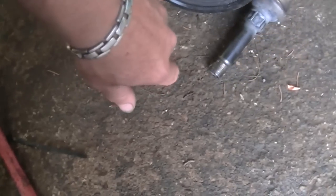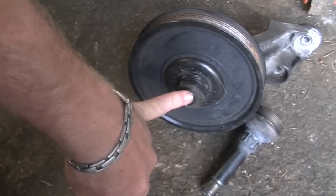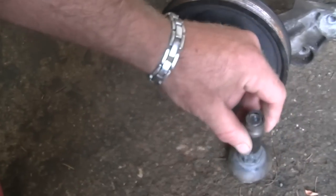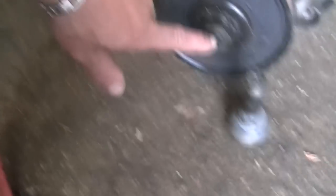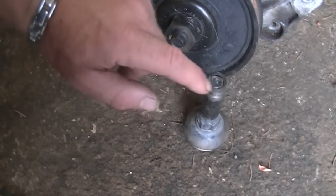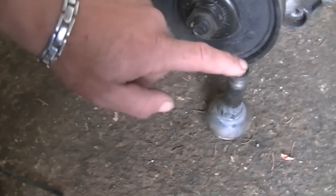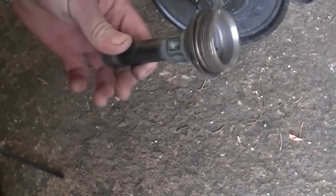The first time, I drilled out and plug welded. That didn't work. So then I ground the surface clean again, drilled again, drilled into the shaft, and then welded again. That didn't work. The third and final attempt was basically drilling through into here — probably about two inches into this — then drilling through what was my weld, getting back to new clean material, and then tapping the rest of those threads. So it didn't work.